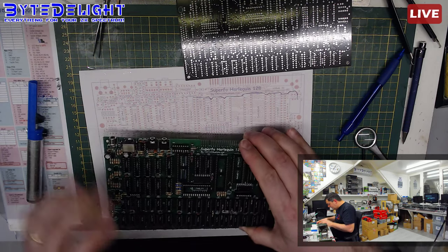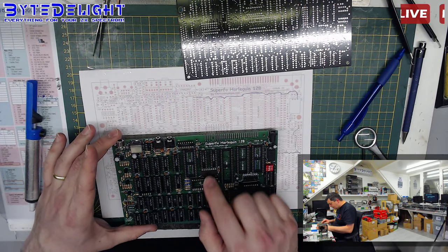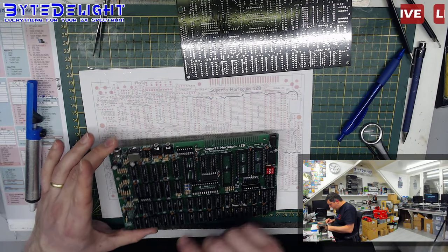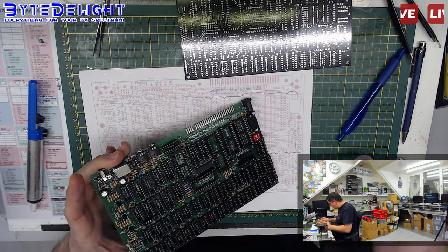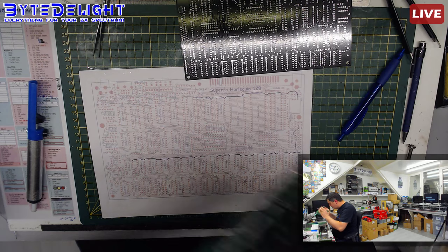So that final chip is off. There are no chips anymore on this board, only that resistor network, which is not a chip, as I told. And let me do one more check to see if the 8724 tracks are clean. And there are no shorts there. There are no shorts, so that's no problem at all.